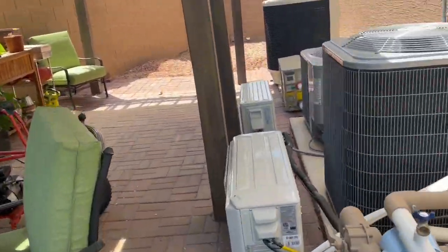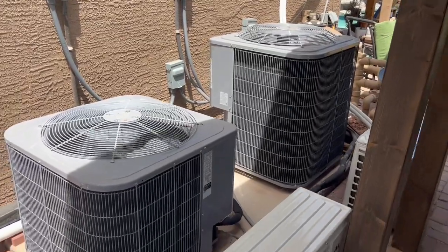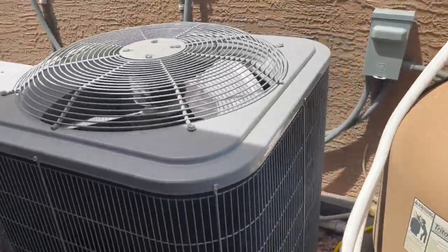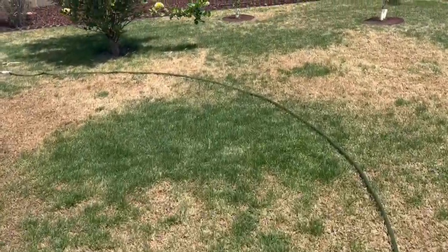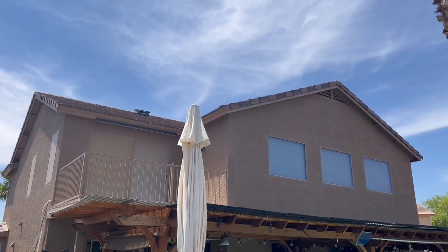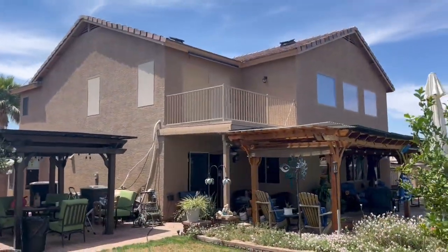Out here, that is the 3.5-ton running right now. And that was with the 4-ton running — 7.5 tons total on that 12-kilowatt low-frequency off-grid inverter — and it'll start up and run both of those. Right now I only have 42 250-watt used poly panels on this. If I put probably 60 on there, I'd probably be able to keep charging that battery full at 54 to 56 volts and be able to run both air conditioners at the same time.